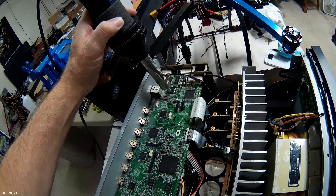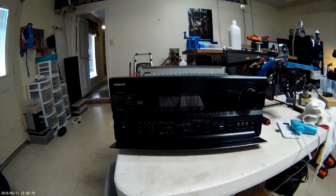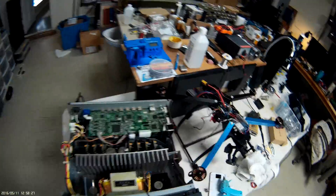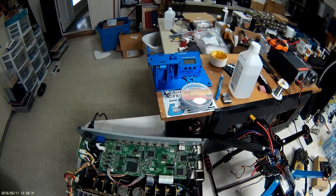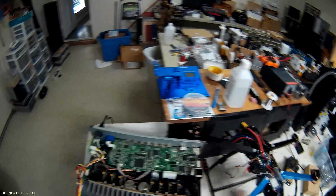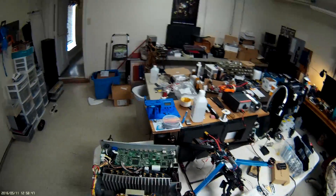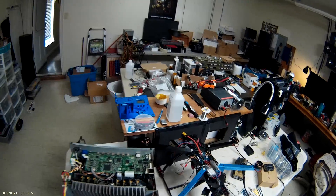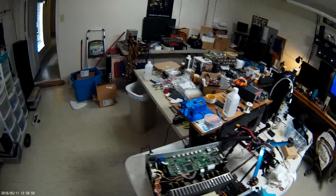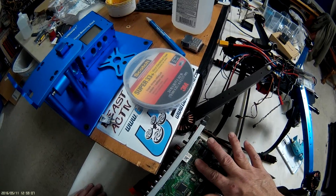I'm going to do it for a little longer this time. If the chip is bad, I can reball it — that's not a problem, it's just harder to do. Let it cool off and turn it off. To reball, you need a suction cup removal device that attaches to the top of the chip. After heating it, pick it straight up. Clean the matrix pads off with a soldering tip and flux, getting them as flat as possible. Under these chips are small sockets where you drop a solder ball in with flux. When you heat it up, those solder balls melt and the chip draws itself to the pins underneath automatically.